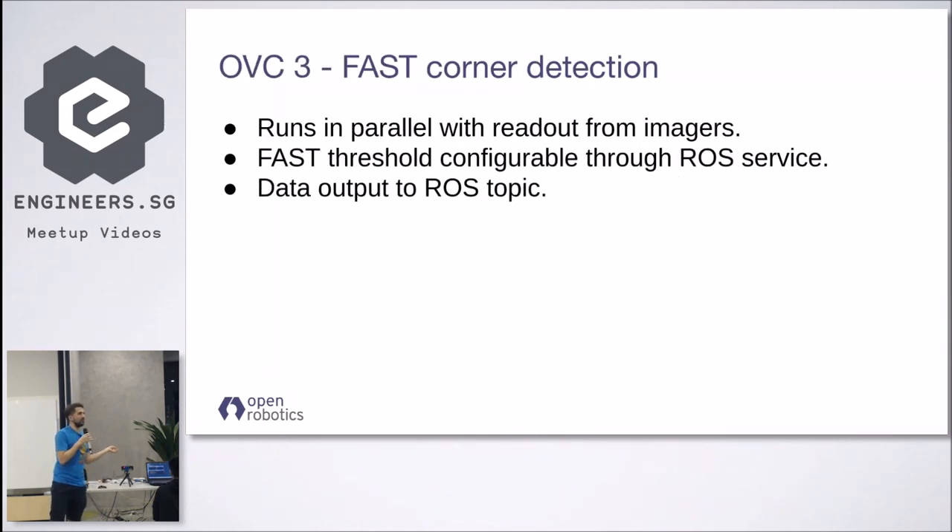It's basically fully plug and play — you just need Ubuntu and ROS running and don't need to install anything else. Hardware-wise, it's very important for visual-inertial odometry applications to have synchronized IMU and imagers. We synchronize them together and stamp them with the ROS time, so the timestamps are already in a format easy to integrate with any ROS package. We also output corner features from the FPGA for visual odometry pipelines.